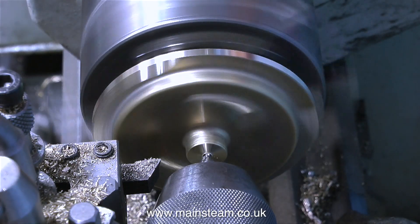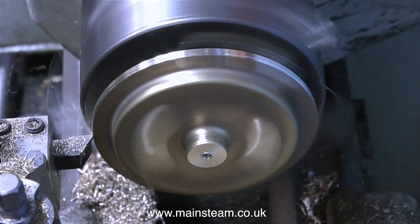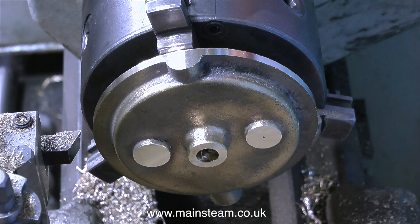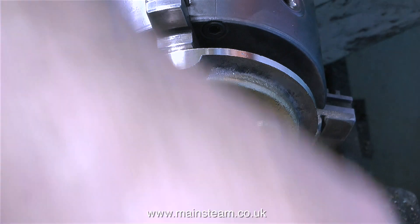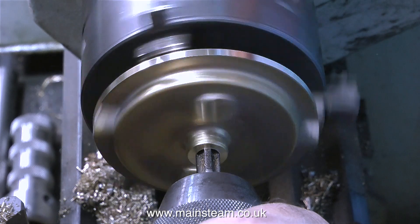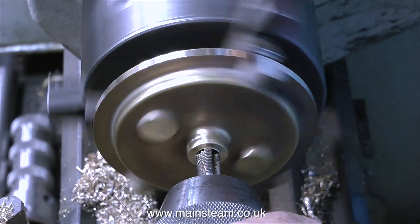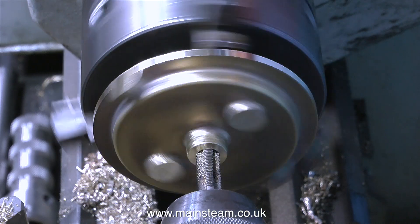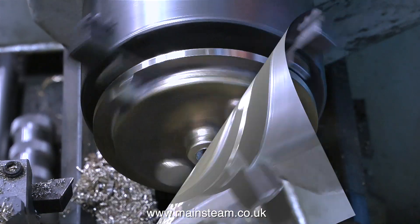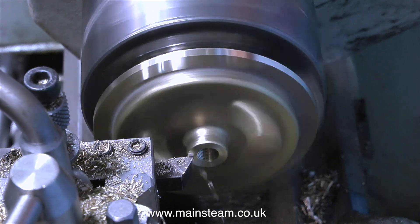After facing off all of the casting bushes, I'm using a centre drill first to drill through the centre bush. The next job was to drill the centre hole two imperial drill sizes less than 3/8ths, which is tapping size for 3/8ths by 32 threads per inch. When I first started the tapping process I was turning the chuck by hand, but very soon I was losing the will to live. So I put the lathe into back gear to slow it down and let the lathe do the work, then put the lathe into reverse — and it's a good tip to just take the weight off the tailstock so you don't enlarge the thread as the tap winds out of the hole. To finish this part of the job I wound in the lathe tool to clean up the centre part and remove the ragged edge of the thread that the tap left in the hole.